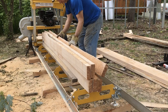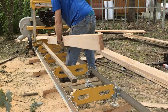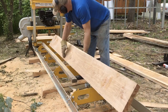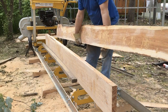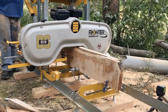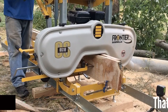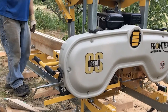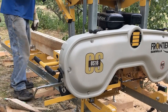To properly cover the trailer I'm going to need 14 pieces about 44 inches long. These logs are a little bit over 8 feet but not quite 9, so they'll definitely be long enough to get two lengths out of each. It looks like I'm going to get 10 boards that are 1 and three quarter inches thick and 4 and a half inches wide, which is awesome. The extra pieces I actually have another project in mind for — I'm going to set them on my drying pile in my shipping container and get to them later.